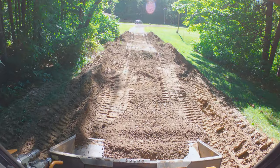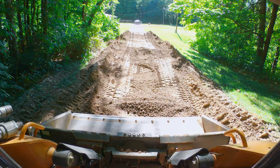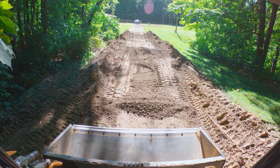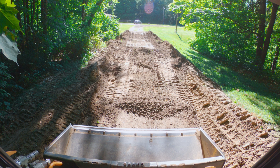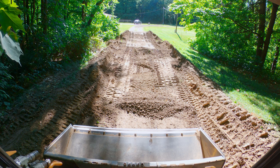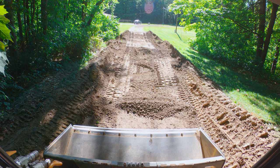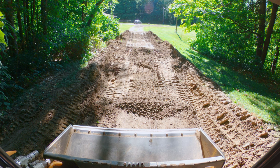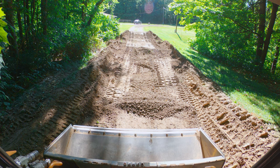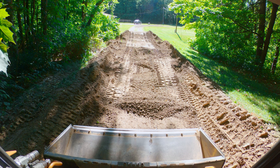We're roughly four inches thick all the way out here in the front — I know exactly where I'm at with material, I don't have to guess. If the machine were spun around and we were grading from that direction, my existing grade would be underneath the machine and I'd have no gauge for how thick my material is. Grading in this orientation, you can put down the exact amount of material without guessing or getting out to dig a hole. I know the whole way up this driveway I've got four to six inches. As always, I hope this has been helpful — drop any questions below and we'll catch you on the next Down and Dirty.